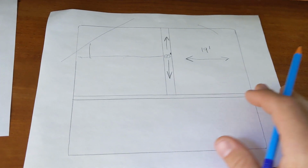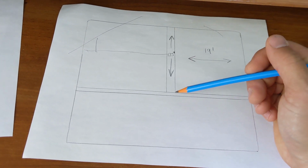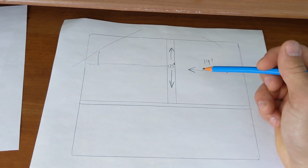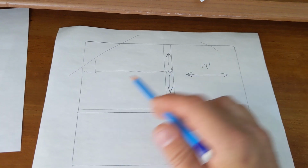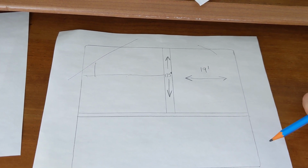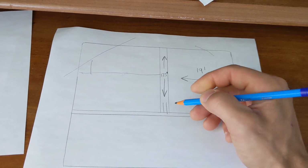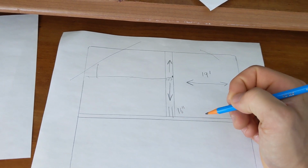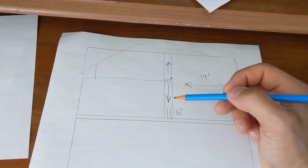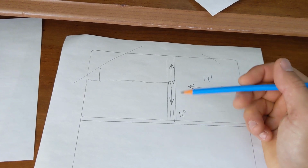And so when I gave all of these measurements to Boise Cascade, they took all of this into account. So they put it into their software program, and they said, okay, bearing for the beam is at 17.5 feet, and then you're going to have I-joists that are going to be covering a 19-foot span from either direction, and then you're going to have load coming down from the roof onto the I-joists. And so they computed all of that, and they said that I needed a triple ply. So this is a triple ply 16-inch LVL. So 3 LVLs, and they're 16-inch, and that they needed to have 5-inch special truss lock lags every 12 inches all the way across the beam, 3 rows of them.